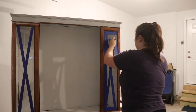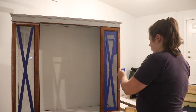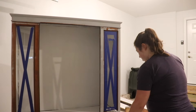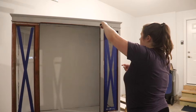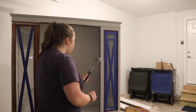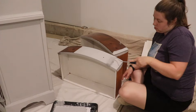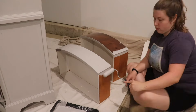I did need to tape the inside of the glass portions of the china cabinet. There were two glass sections, and while I had started prepping a third glass section in the middle to treat it more like a cabinet, I ended up not doing that after I realized I liked the open vibe with just the two glass sections on the sides. On the exterior there were two coats of the gray chalk paint. On the interior, everything had four coats — two coats first, then realizing there was bleed-through, so one coat of primer to hide the tannins, and finally one more coat of white chalk paint.